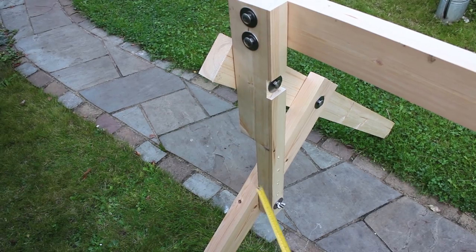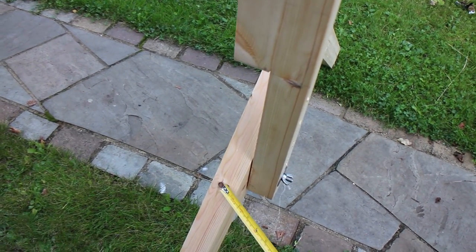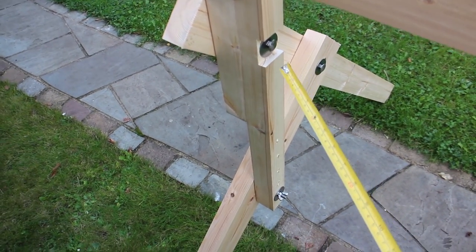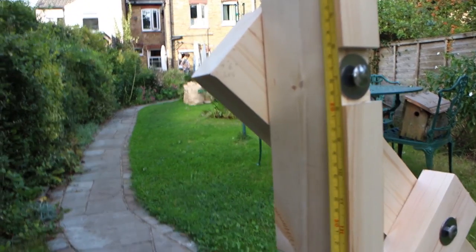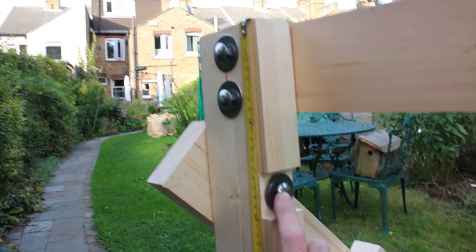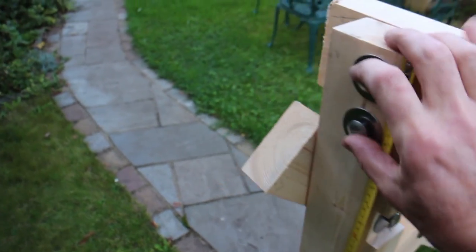Just to recap on the shorter leg — it's two foot two inches long, and I've cut a recess here for a foot. That recess is basically just the thickness of that part of the leg, and then a bolt goes through. That bolt is at seven inches down from the top of the post, and it simply goes through to secure the long leg.